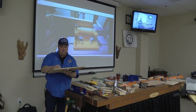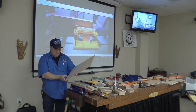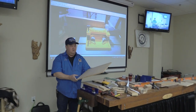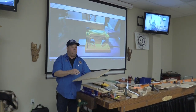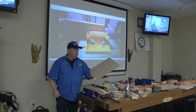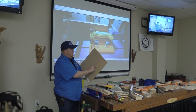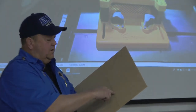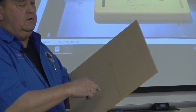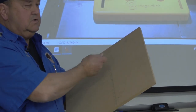And you put a pivot point on, and you have parts on here that you can use for bandsaw circle cutting. I didn't see a real need for it for the most part, because you can just turn it by hand and make your circle cutting. But you have points on here that you put it on. You would put a nail through here to whatever you're cutting, and that tells you you're going to cut a 7-inch radius, and you just turn it right into the blade.